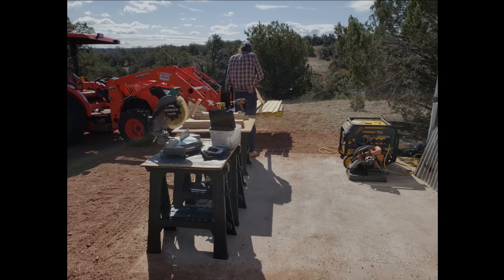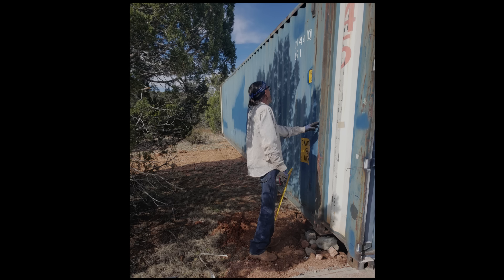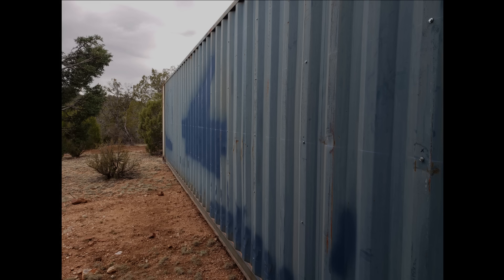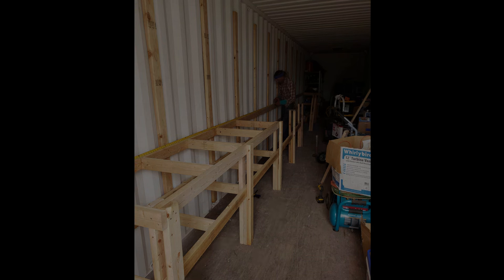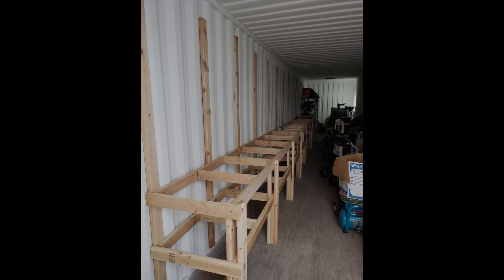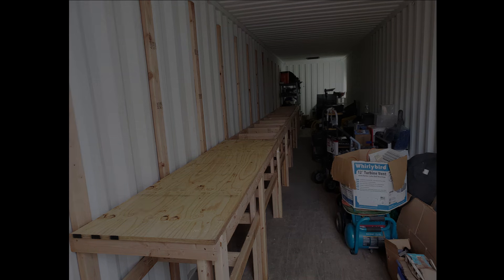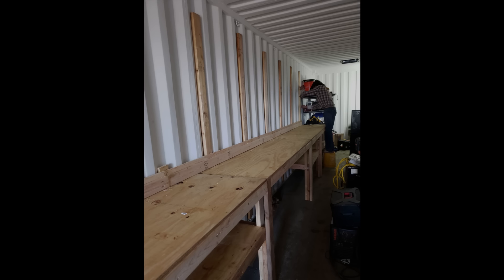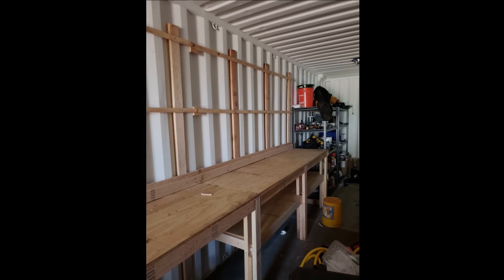For the interior, a workbench 32 feet in length would be constructed. A miter saw workstation was set up to allow fast, precise cuts. 2x4 studs were used for framing on the inside and fit perfectly between the corrugated metal siding. The studs were attached to the steel siding from the outside using metal-to-wood roofing screws. The design included a row of shelves below the worktop, with 3/4-inch plywood used for the worktop. Furring strips were installed to create additional area for the pegboard to adhere to, which proved excellent for organizing tools and keeping them visible.